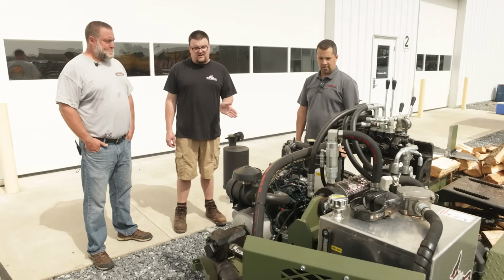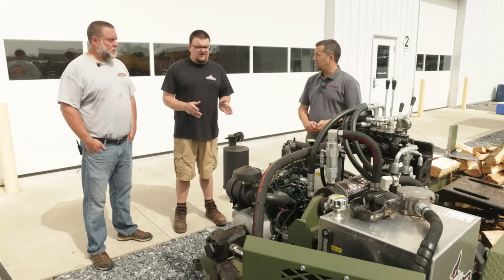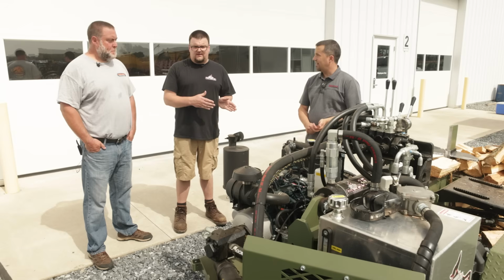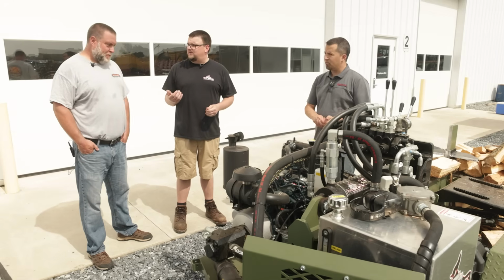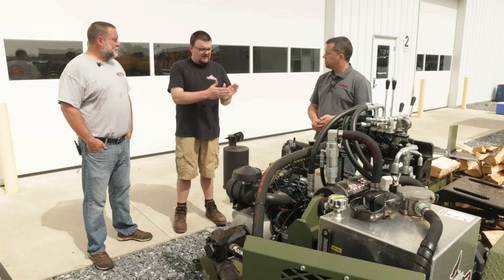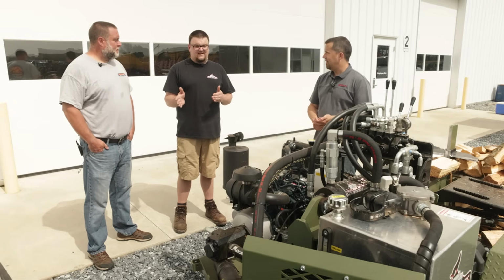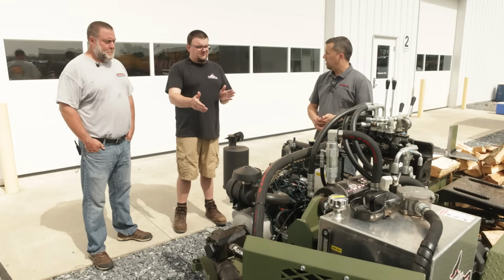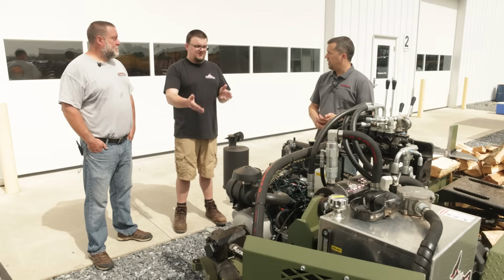And he went from a 35C, which has a smaller pump, still a 35-ton cylinder. But if you would have had the Honda engine on the SHO, that would have been a V-twin, whereas it was a single cylinder on the 35C. So the cycle time, if he went from a gas engine 35C to a gas engine SHO, he would still have had a 1.5 seconds faster cycle time. And then you add the next step up engine, and then you add the diesel and that 38 gallon per minute pump, this thing just flies.